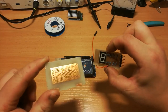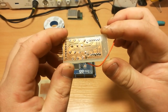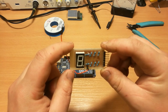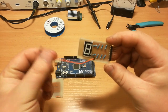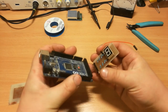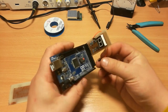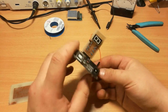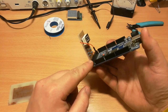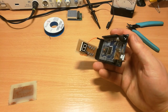I have already made one earlier. This is the board it was used to make. The soldering is completely horrible - sorry for that, my soldering iron tip is not good at the moment. This is a driver for a seven segment display, basically an adapter plate for Arduino Mega. This is a common cathode so you drive it with plus voltage. I used a 90 degree angle connector here because it's hard to solder the header on this side, and this is a one-sided PCB, so this was the best option.